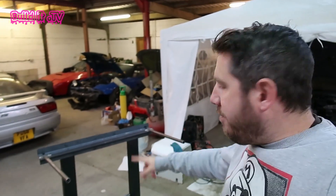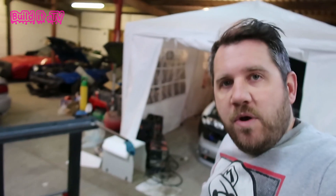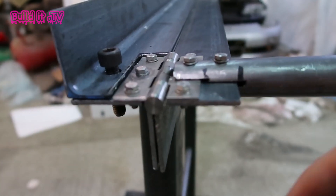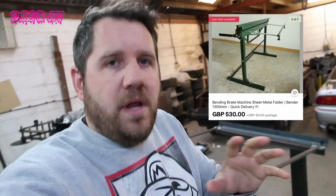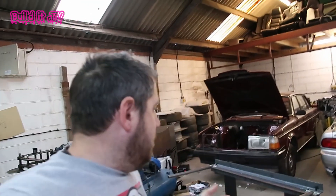And there we have it — with three metres of box section, three metres of angle iron, and a metre and a half of tube, we've got our bender all done. You can see I've notched the tube to go around the hinge and the bolts go right the way through, utilising the same bolt. If we ever need to undo this we can just undo those two nuts, slide this off, chuck them on top, and transport it away. So if you need to bend some angles and you don't want to spend thousands of pounds on an expensive bender, this is a great way of doing it — I think it cost me about £75 in total: hinges, metal, everything. A day's work and about £70 worth of metal.